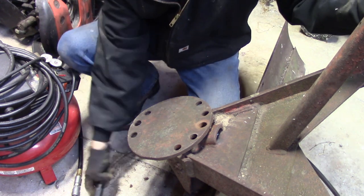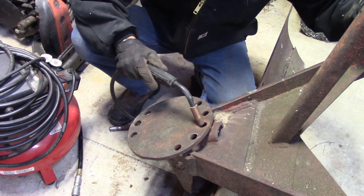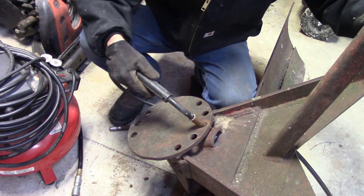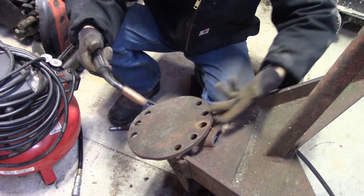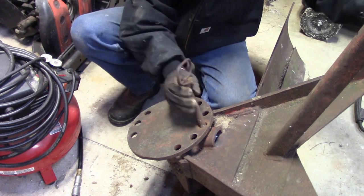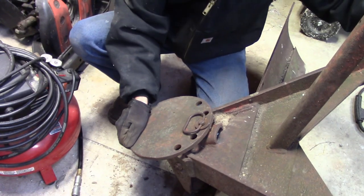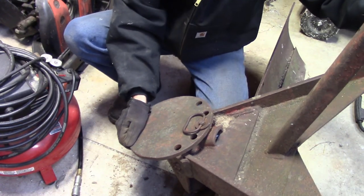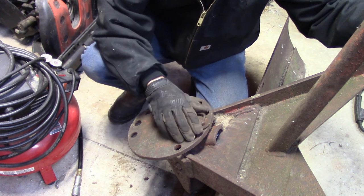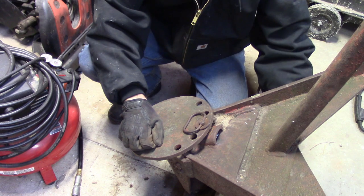I did take the welder and I was able to tip this a little bit, get down in here, and put just a tack of weld on this side of the collar and then on this side of the collar. You really couldn't see anything so I didn't bother filming that. But now the pin drops in there just fine and we've got a lot less slop than we had before. Now I'm debating going back to the hardware store and picking up another one of those collars and welding it up underneath. I'll show you where I'm talking about.